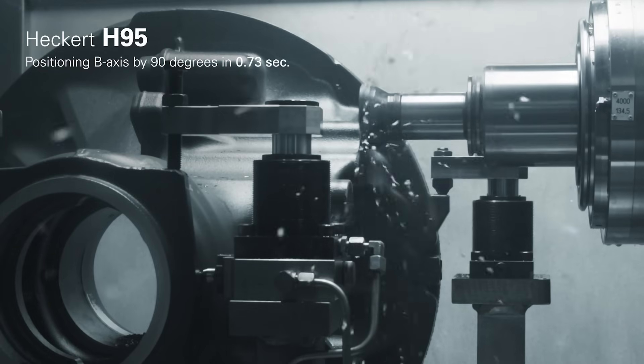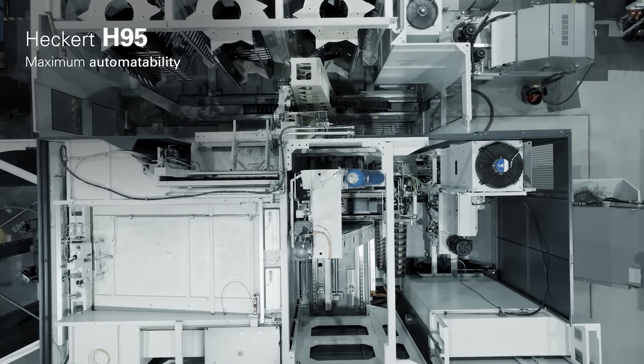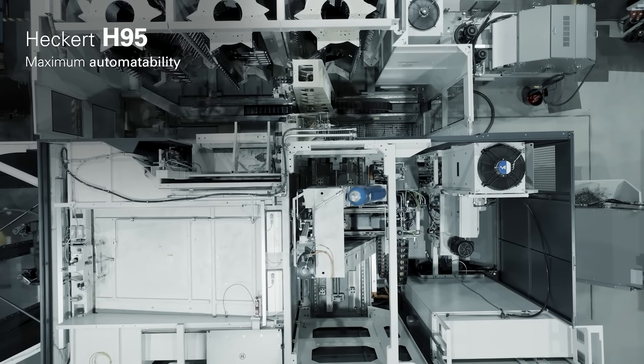Well, it's certainly a machine that we've built for the mainstream market. Some of our machines are very niche for specific products — this is a machine for everybody. The market came to us and gave us feedback on how to improve: make it more compact, so this machine has a smaller footprint; make it faster, so it's an 80 metre per minute feed rapid machine; choice of spindles; choice of tool holder. And it's got to be an affordable price, so this is really geared to the subcontract market as well as the OEMs.